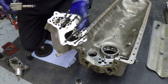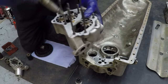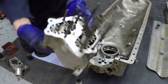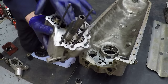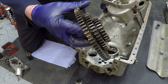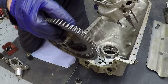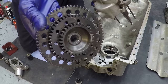The first components to go back in are the two scavenge pumps - they're just conventional gear pumps and I've got this shaft in here. There's this triple gear which is quite an intricate piece of engineering because even as a machinist I don't really know exactly how they cut the gears, the teeth, that close to that face, because this is made out of one piece of metal.